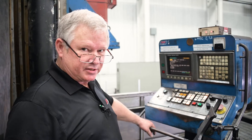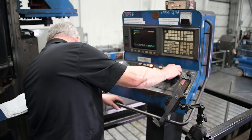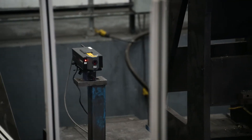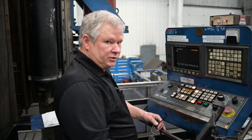Our setup for the XD laser begins at the most negative end of travel. So we're going to move the machine to the most positive end of travel, and we'll make our adjustments there as well to get our laser right in the center of that mirror. Those adjustments will be made on the back of the laser itself. This is the most positive end of our travel, so now we want to go look and see where the laser beam lines up on our sensor and fine tune it to get it in the center of that mirror just like we did on the other end.